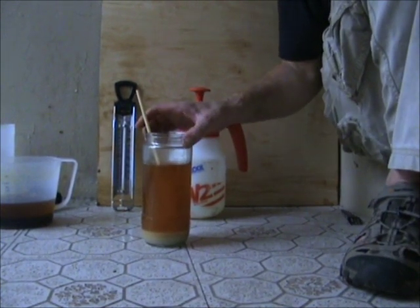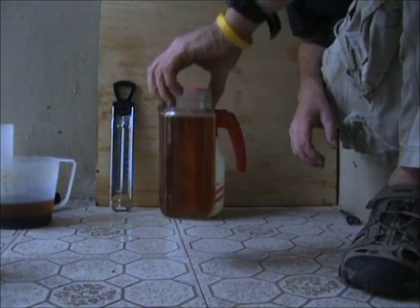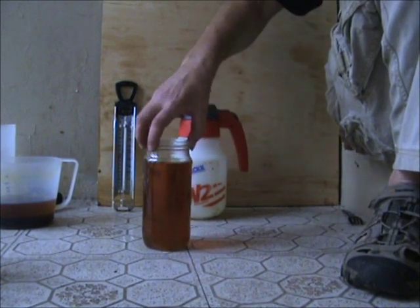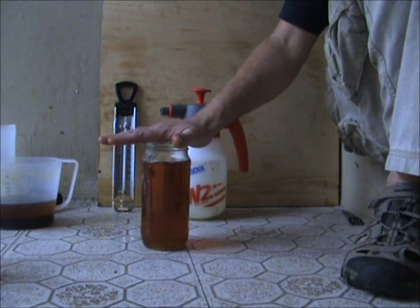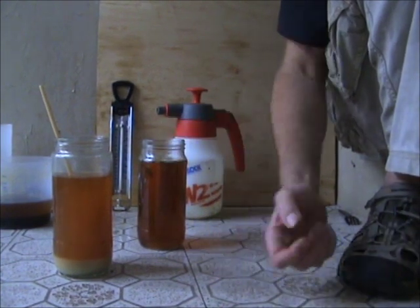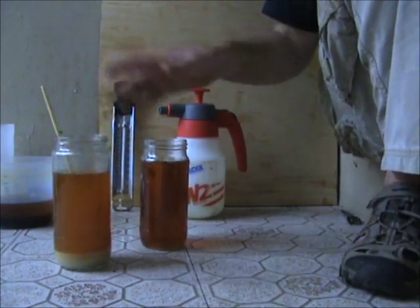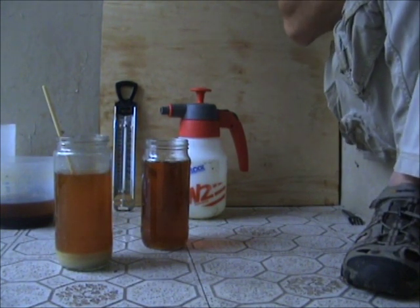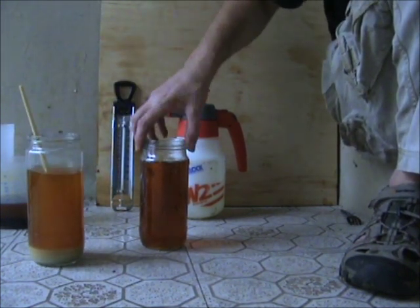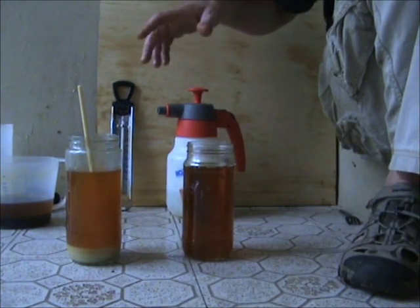Once you've washed it three to four times, you are left with the cream — the amber nectar. This is biodiesel. This is totally finished and has been left to dry. The next process is: once you've washed your biodiesel, pour off the oil — or if you've got a wash tank, drain the water from the bottom — and get rid of the water. Like I said, that process can be a bit tedious, back-breaking, and messy.